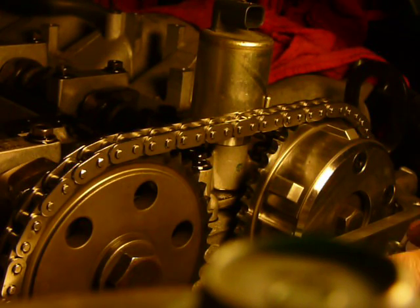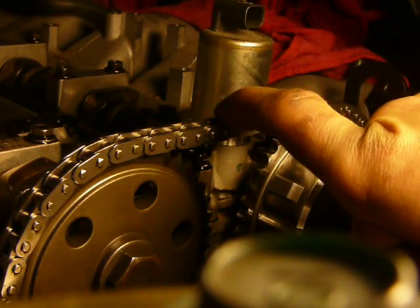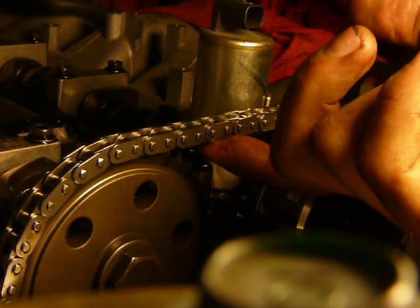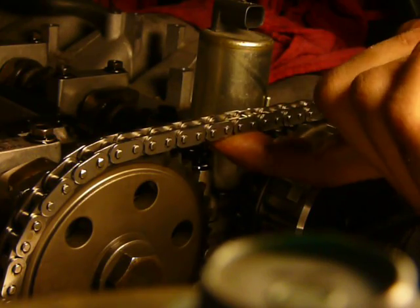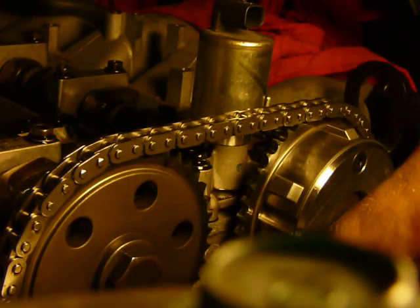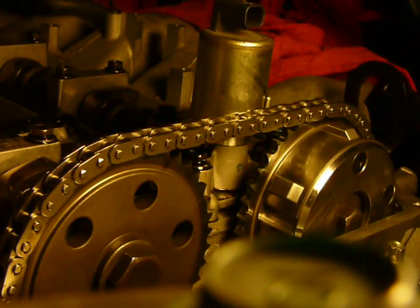That click basically means the tension on the chain below the sprockets got a click tighter, whereas the chain between the sprockets wasn't affected. I cycled it through a couple of times and the difference between loose and tight was pretty stark — probably three or four times that amount. So I had to loosen them both back up and do it again to even out the chain tension, and this time it looks perfect. I'm happy with that.